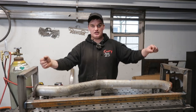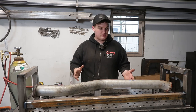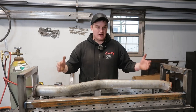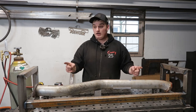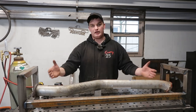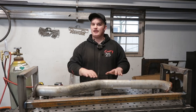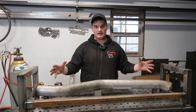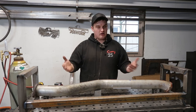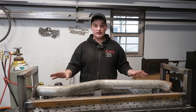I can roll this thing or stand it up on end to get around my flanges in a good position without too many out-of-position welds. Now that we have access envisioned and the frame floating in here, we need to get our connections. One important thing: if you're doing it this style, make sure your frame is completely welded before you lock in your connections, because thin wall tube will warp under welding. You want all that warping done ahead of time — if you tack everything, weld your connections, and then weld it out, those connections could fall out of tolerance.